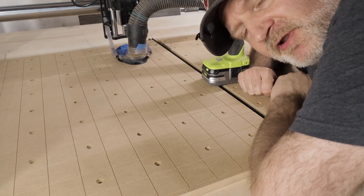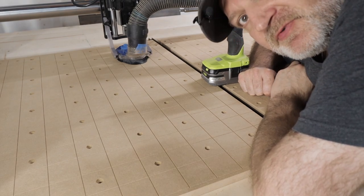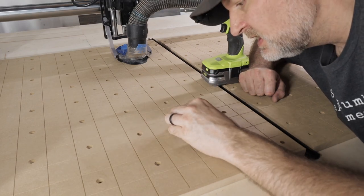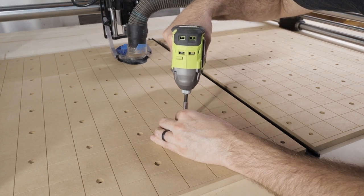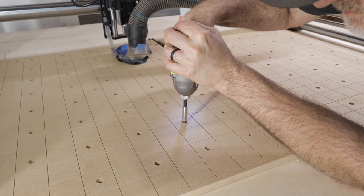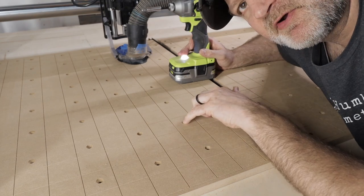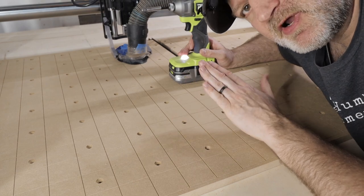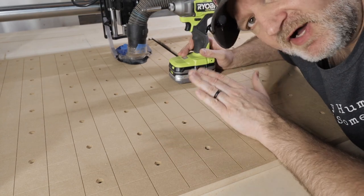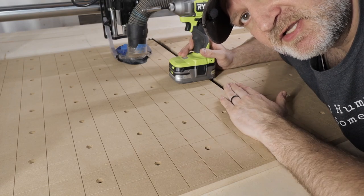I was just talking with my friend Alan over at Lazy Lizard Furniture — follow him on Facebook, link in the description. We were talking about the holes I just drilled — they're pretty small for this insert. When you want to put it in there, you really have to give it some torque; you've got to push down. Myself, I prefer them that tight because this is MDF and we're using it as a hold down — if it doesn't have that compression it's going to want to pop out. But Alan was saying he'd like it a little bigger to make it easier. So I'm going to update the software and make the holes slightly bigger. Thanks Alan for the suggestion.